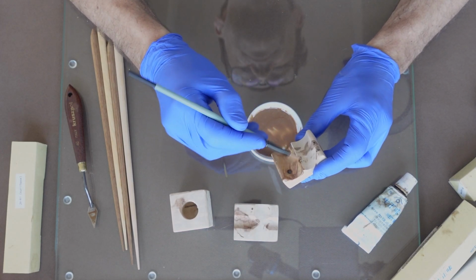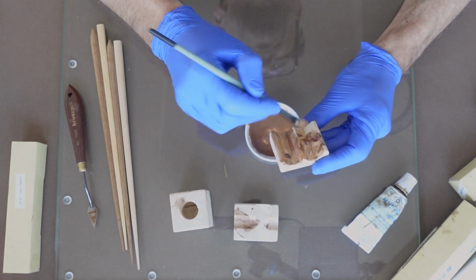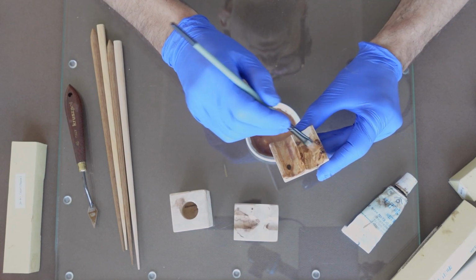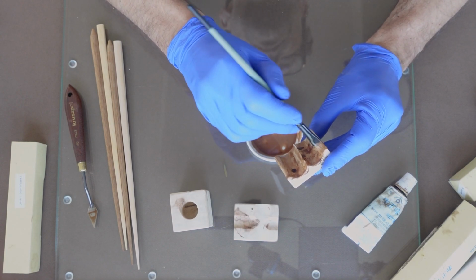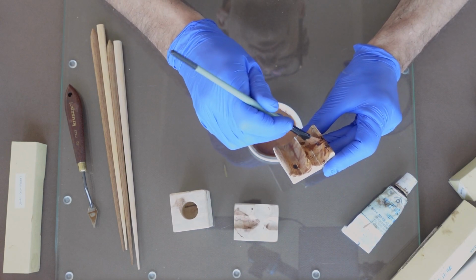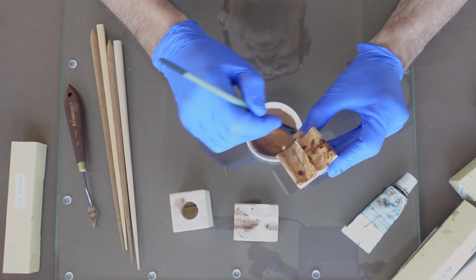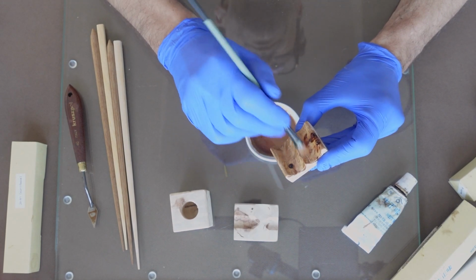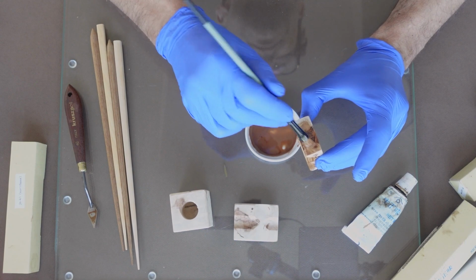As you see, I am quite liberal with the urushi on the barrel, and I will make sure the urushi mixture with turpentine gets into all those pits and cracks in the barrel and soaks in there also. The wood is already changing color. I hope it will be really interesting once finished.